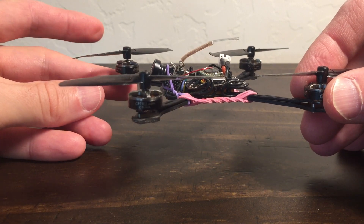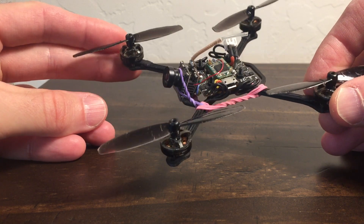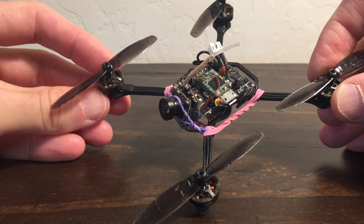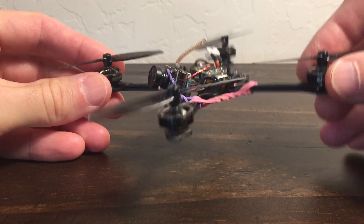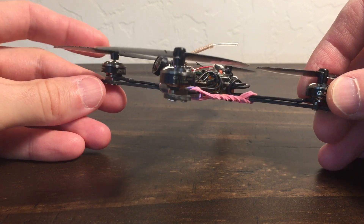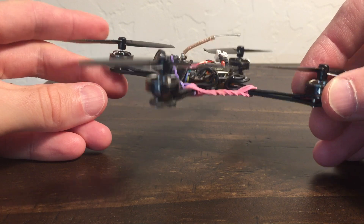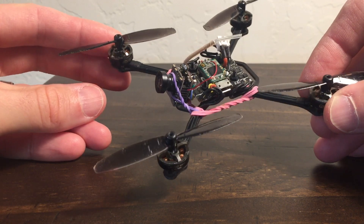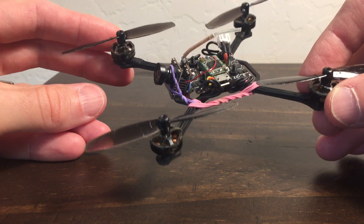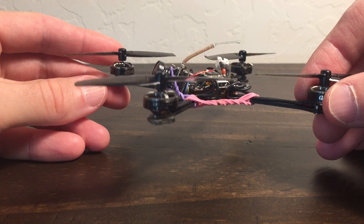Take-home point about these motors: these are good motors, and if you don't abuse them, it's going to be pretty tough to get them to fail. There is enough variability in all things micro FPV — take that with a grain of salt. You might get a bad batch. But my batch held up well to non-abusive stuff, and even abusive flying. Where they failed was abusive prop-changing.